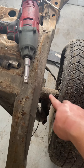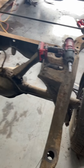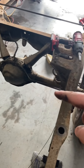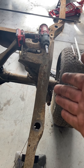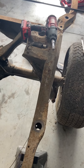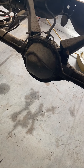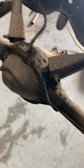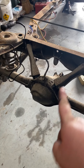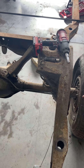As you can see, the rear end is factory width — this is an eight-inch. You can actually put a 20 by 10-inch rim on this thing. The coilover kit has a bracket that moves the coilover bolt location over about an inch so you can fit a 20 by 10 rim in there with plenty of room. If you want to cut the rear end to get that deep dish look, that's up to you. This is a GM passenger car 12-bolt, and like an 8.8 on a Mustang, you need to weld those axle tubes so they don't flex. I'll also put a girdle on the carrier with pressure bolts, eliminate C-clips using eliminators on the outside, and add disc brakes.